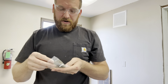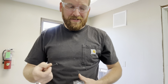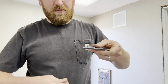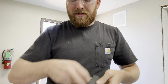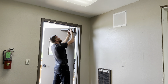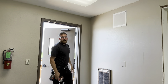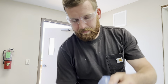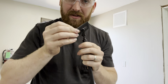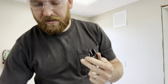In your packet of hardware you're going to find four screws similar to the previous ones, except instead of having a bevel on the back they just have a flat. We're going to stick this bracket with the nub facing down, and these screws will go up through there and sit nice and flush on the bottom. Now take out the arm from the blue packaging. We're going to remove this piece and replace it with that bracket we just installed — unscrew the back, take that off, and set it to the side.